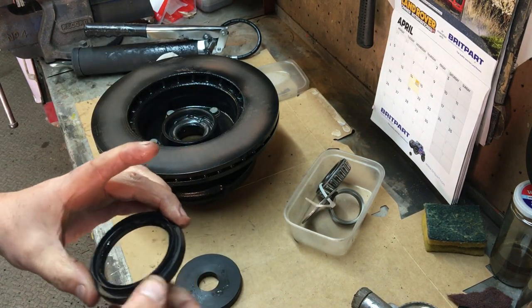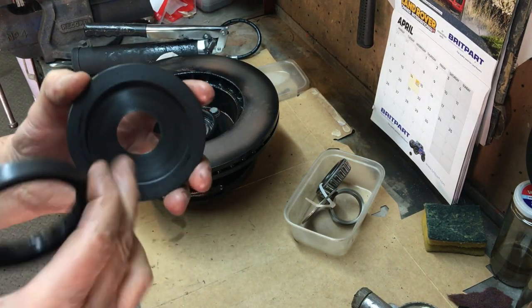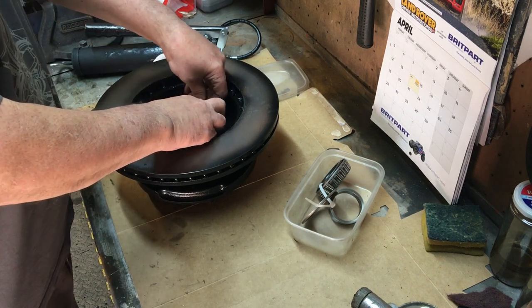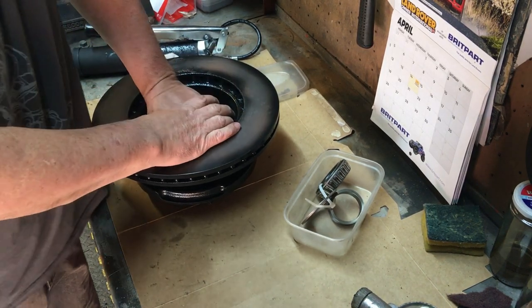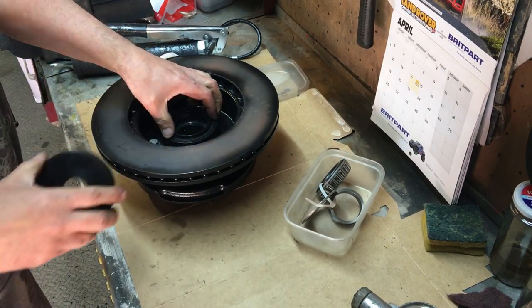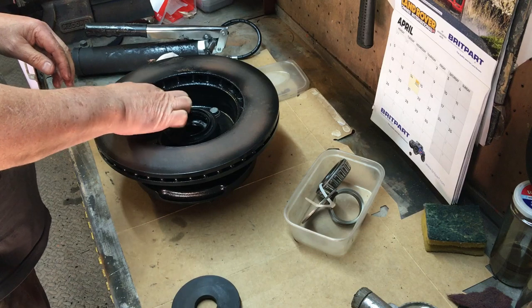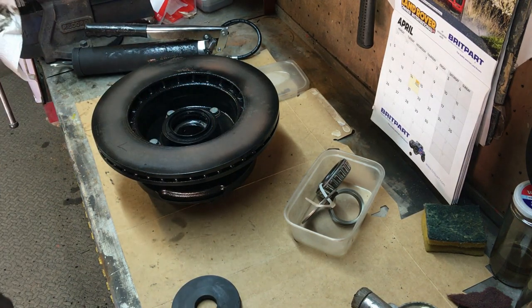If it was just the one I would find a socket or a bit of tube, or use the old seal. But as there are four of them I thought I may as well make this up. If you want to get one made, it's 71 millimetre bore, 6 millimetres deep. So we put this on here and get it going — that is actually a very easy fit. Maybe I'll just fit this by hand. I was going to put it on the press but I don't need to. That's in that easily. Then get a little bit of grease on that lip from what's in the bore — just like so.